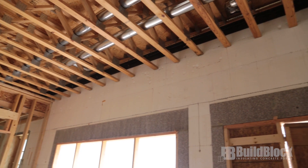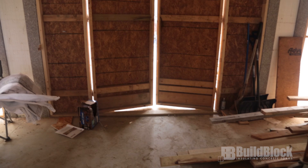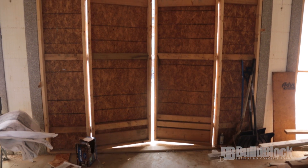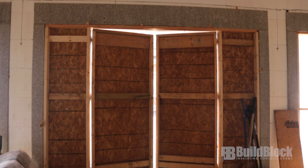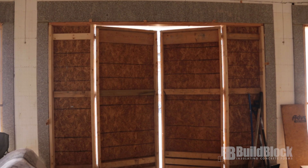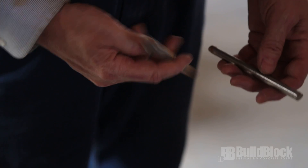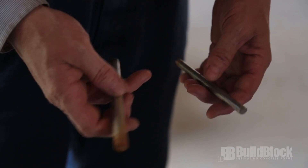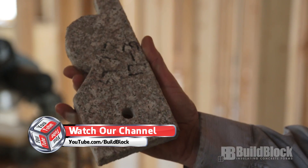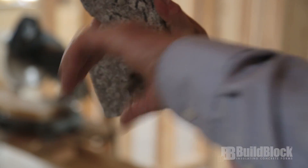Something kind of interesting: these granite pieces are the full thickness of the ICF. The ICF is cast right around the granite, which holds it in place. It also has stainless steel pegs — there are holes drilled in the granite — and stainless steel rods that anchor it into both the sides and the top. So all the granite that surrounds the windows and the fireplaces, every place where a stone is connected, has holes drilled in it, and the masons used these stainless steel rods to keep the pieces together and keep them from sliding apart.